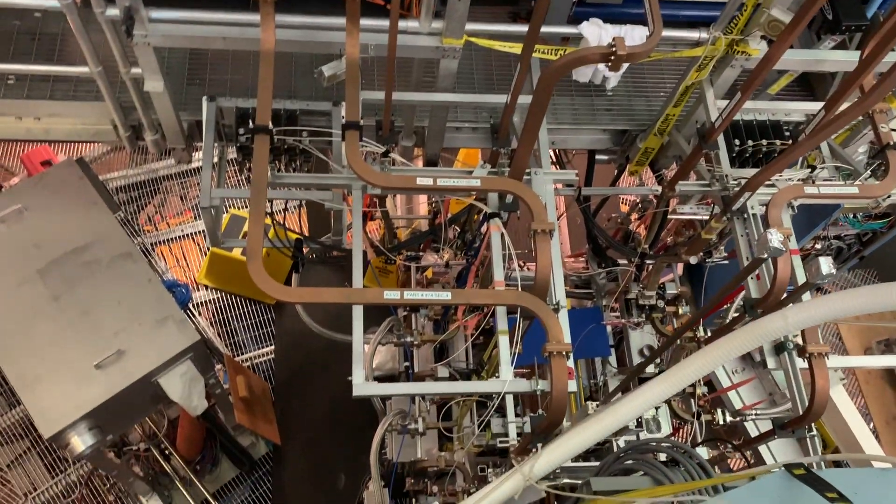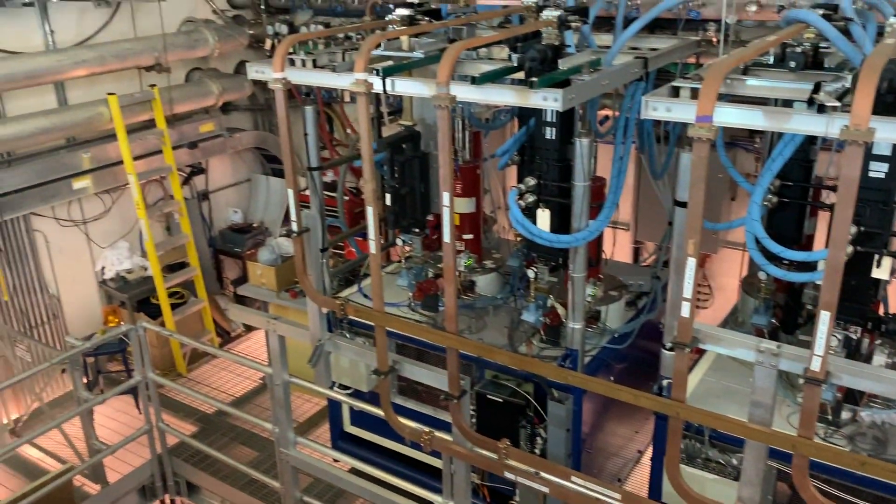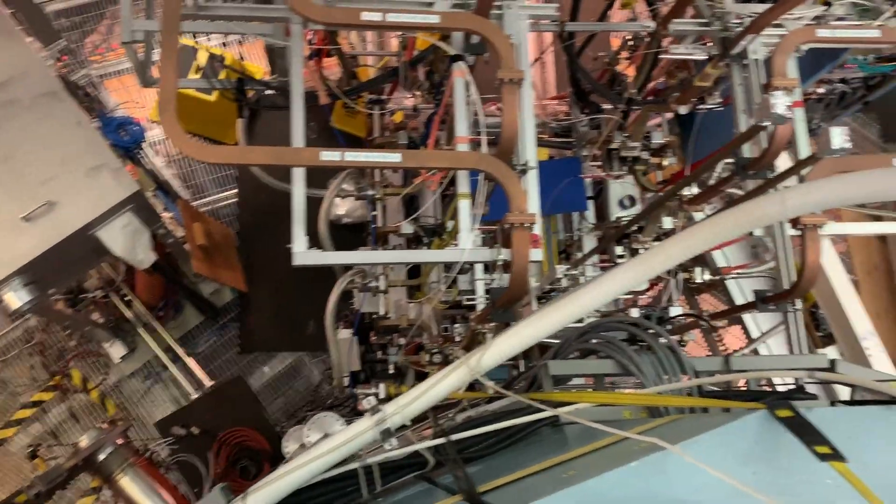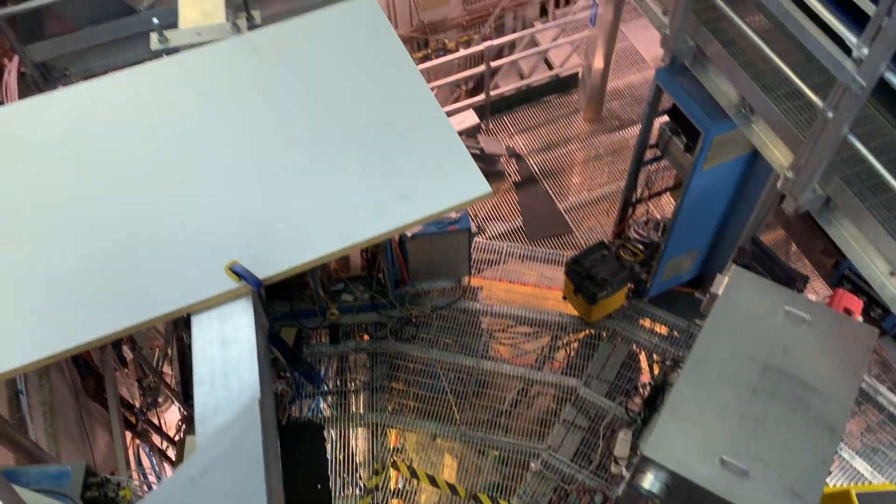So it's a phased array microwave injector. Is that right? Yep. It's at 4.6 gigahertz, which is right where the microwave oven operates. And that gets the wave going. Are you pulsing it in sync with its time to propagate around the circle? No, that doesn't really matter. You sort of just keep adding energy. Yep.